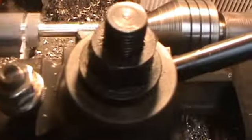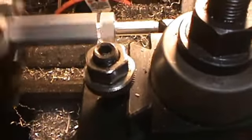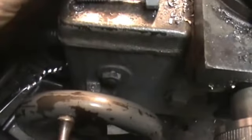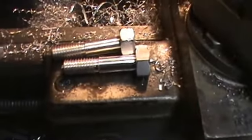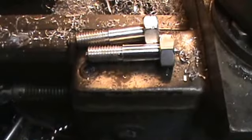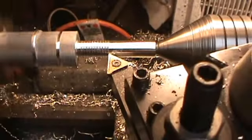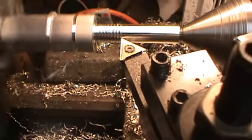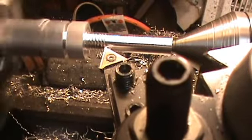Here's Mr. Bolt done — cut to the right length. I'm just cutting it off with the parting tool. There's the finished product; it needs a little cleaning up. But I'm getting this technique down — it looks like it's easiest to turn one bolt at a time with fewer tool changes. I'll make a few more here and try to get a whole set so I can get pictures of them. This one's roughed out; I'm doing the final cut now within a couple thousandths, which is plenty good for a bolt. Looks like I've got some technique down.